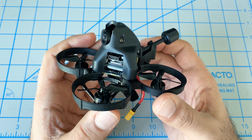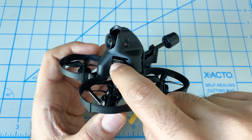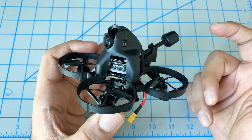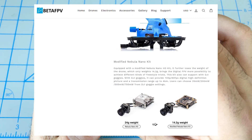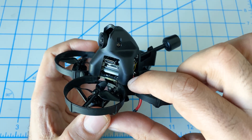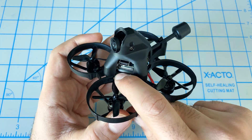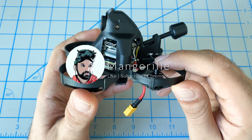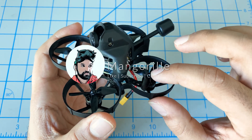As a follow-up, we're going to do a decased Vista — remove the case to save around 10 grams of weight, which is what Beta FPV does with their quads. At the same time, we're going to try to make the canopy a little bit shorter by cutting a bit at the bottom. And finally, we'll try to update the ESC firmware to turn on bi-directional DSHOT. Make sure to stay tuned and hit that subscribe button for those upcoming videos.